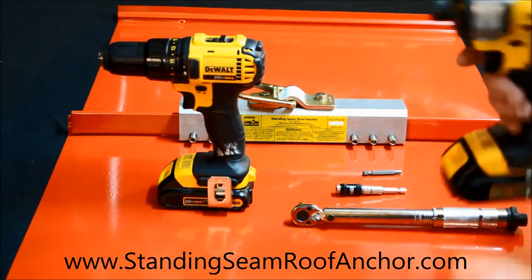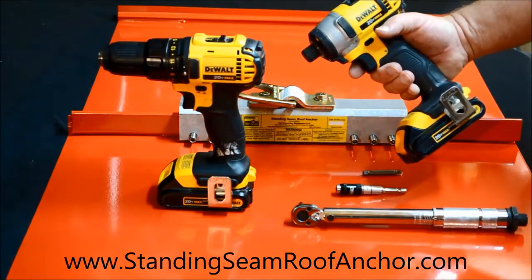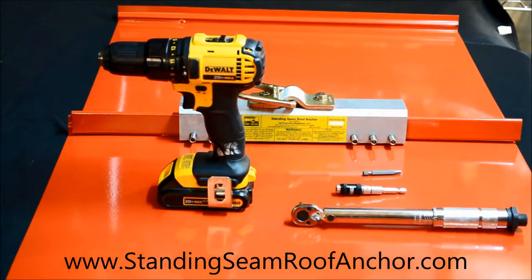You could also use, if all you have is an impact gun, you could use that. But just remember, on the impact gun, they don't have clutches. And if you stay on that trigger, it will drive that screw way over 90 inch pounds, which can damage the seam. So we don't want that. So a screw gun with a clutch is the best way to go, because you can set it so that you don't over torque it.